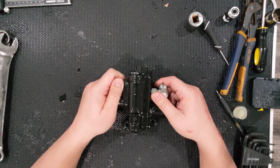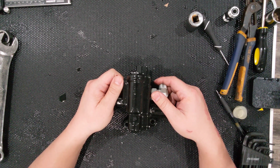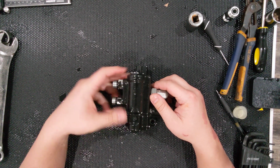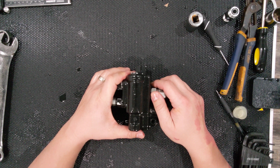For those of you following along, the concept of taking what is about 3.5 gallons a minute that's going to the steering and taking 1.5 to 2 gallons of that a minute and putting it on the implement side really does make a difference. Now, that said, it makes a difference at RPMs starting around 2,000. You see a significant bump at 2,500, and at wide open throttle, it's really noticeable and noticeably faster.